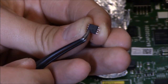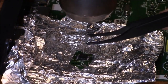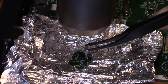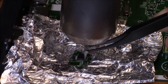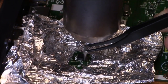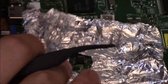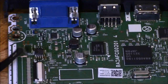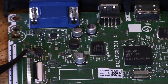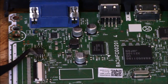The dot indicates pin 1 on the EEPROM. That's pretty much it — you just remove the tinfoil now. After you're done, check to make sure your pins are not soldered together. You can also clean the surface using a toothbrush and alcohol.